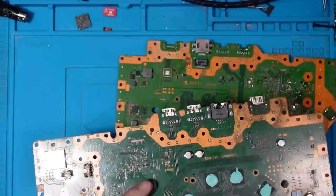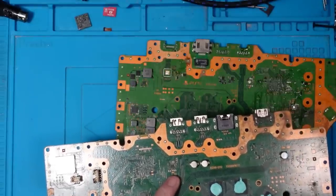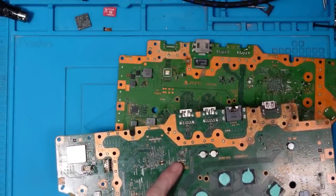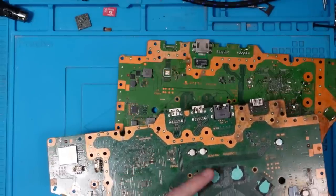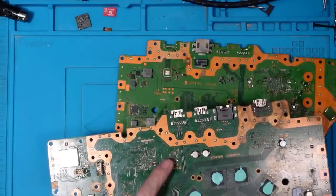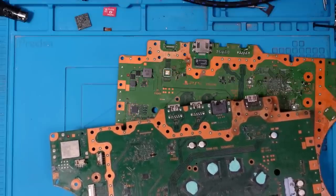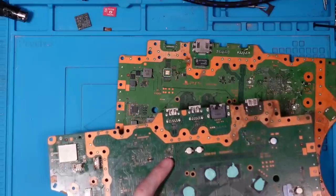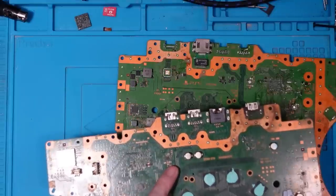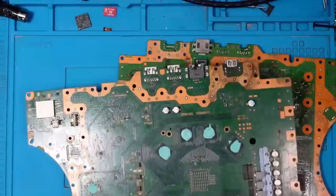Number one is where the fuse just blows, and other times it's blowing because of a short circuit in that area. We're supposed to get 5 volts on one side of the fuse, coming into this chip, which handles 3.3 volt regulation — it comes out through this inductor and then off to where it needs to go. Sometimes you'll have a short on the capacitors here, and sometimes on the chip itself. You can get the chip off AliExpress though it will be expensive. The fix is to replace this chip, replace the capacitors if they've failed, and possibly replace the fuse as well.